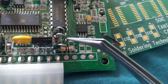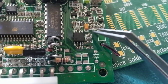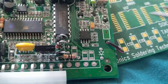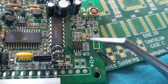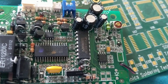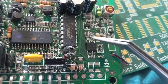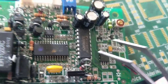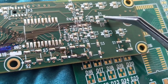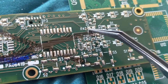So the through-hole, as you can see over here, they go right through it, through the holes. Through-hole, through the holes, not these. These are laid upon. The component is laid upon, and when I get my tripod, hopefully when I locate it, I can actually show you how to put them on for any PCM board, for any computer board, like I specified before. So taking this into account, this is called surface mount. Again, surface mount, the components are laid upon, and these are the pads that make the connection.